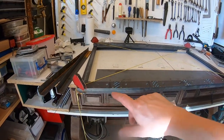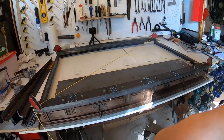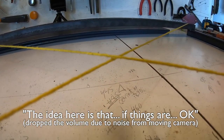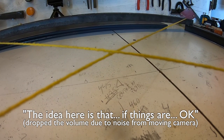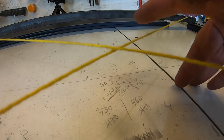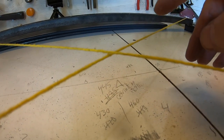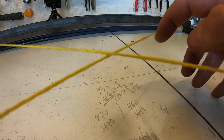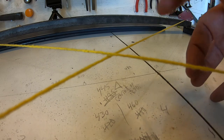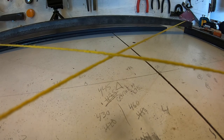With the corners tack welded I'm doing the string test — one string from one corner diagonally and then another one. The idea is that if things are square the strings should try to occupy the same space: if I lift one it wants to settle on the other, and if I push the other aside they want to pull up. Gravity plays in a little bit, but basically they want the same space. That's pretty good.